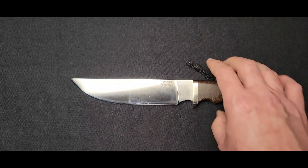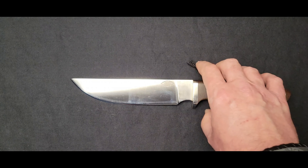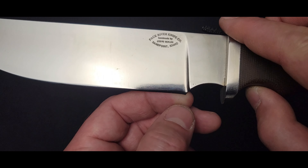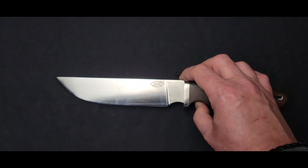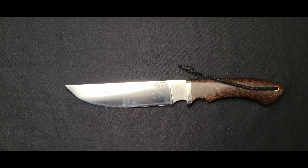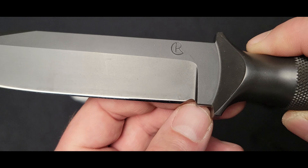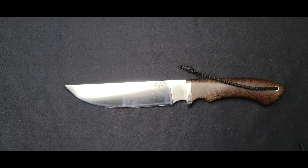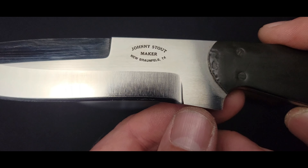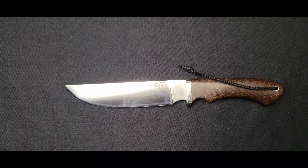Typically, I prefer if the edge carries down beyond the plunge, allowing you to sharpen off the back. That brings you to what's known as the heel. The heel of a blade is the very end of the cutting edge, and it can be represented in a lot of different ways. Like this one here, it just drops below the plunge. This one here we have a sharpening choil, which is a notch that is physically cut behind the edge before the plunge. Or you can simply have a heel that terminates directly into the flat of your blade. All of these are acceptable — everybody has their different preferences, but they all work.